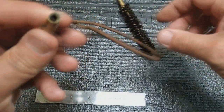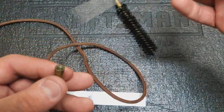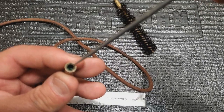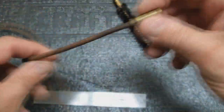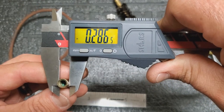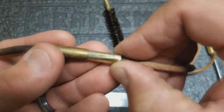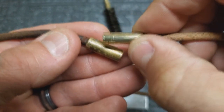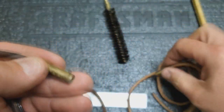This is natural materials, so there's going to be some variance. Coming down here we have our threaded area, which I figure is about a quarter 24. You can see there's a slight recess right there, and the thong coming through roughly halfway in, which is held in by that pin. The stock they used is a little bit bigger than a quarter of an inch. I use quarter inch when I remake mine and you can see it's just the teensiest bit too small — if you wanted to make it dead on exact, you would need a machinist lathe.